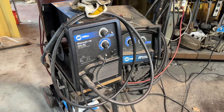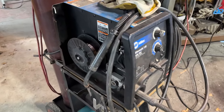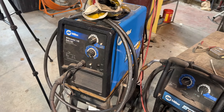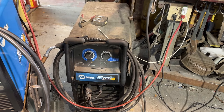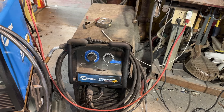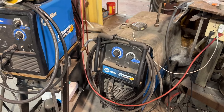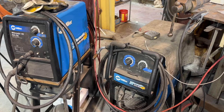I was using my Miller 140-amp welder. I keep it loaded with 0.024 wire — I'm about out. I like using that wire on all my sheet metal jobs; usually I don't have to do a lot of grinding. My larger welder, the Miller 212, I keep 0.035 wire in it. That spits out a lot of wire, and if you want it to lay flat, you've got to run it real hot. Even then, there will be a little more grinding if you're looking for a perfectly smooth appearance. Both welders are good, and I've had them a long time — never had a problem. I'm running an argon CO2 mix in both of them.